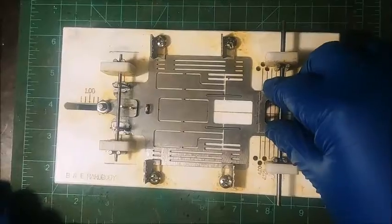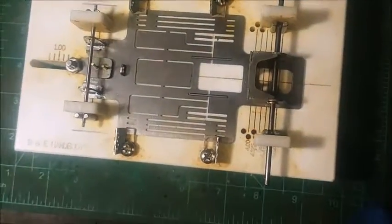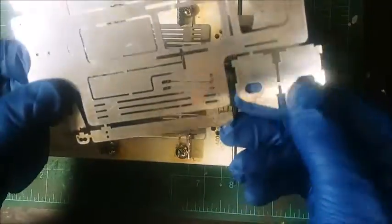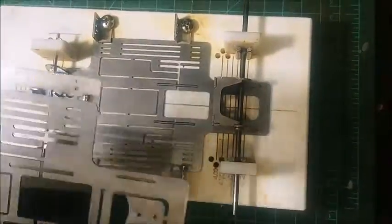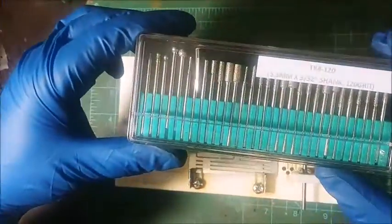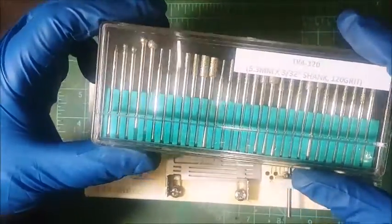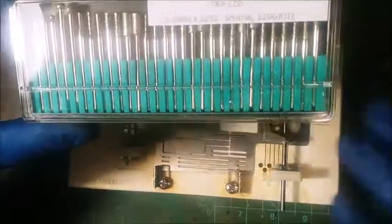So I went ahead and I assembled everything in the rear. The whole back end basically goes together where you have side uprights. Okay, you're going to cut those out. And then there's the motor brackets, which I set off to the side, and then there's a brace that holds it all together. So you're going to have to go ahead and get yourself some decent diamond burrs or parts from your hardware store, Dremel department, and you want to go ahead and clean up the chassis, all the little burrs and stuff that's on there, so that everything fits really nice.